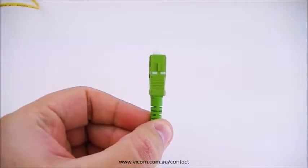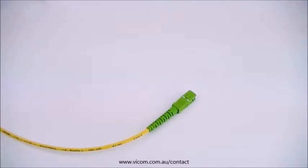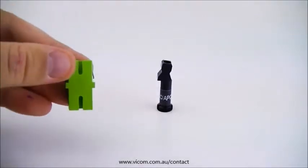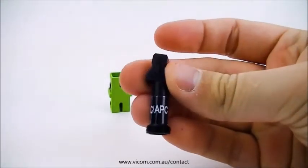As a result of their angled design, these fiber ends must be inspected in a slightly different way than others. Technicians who are inspecting angled fiber ends will need an SC simplex bulkhead adapter and the SC-APC inspection tip for their VIS-300 or 400 inspection scope.